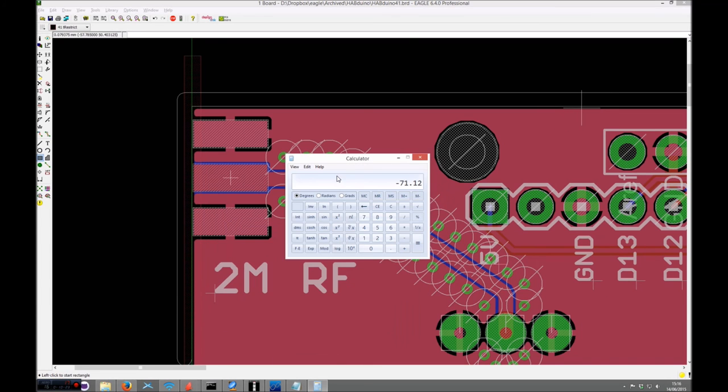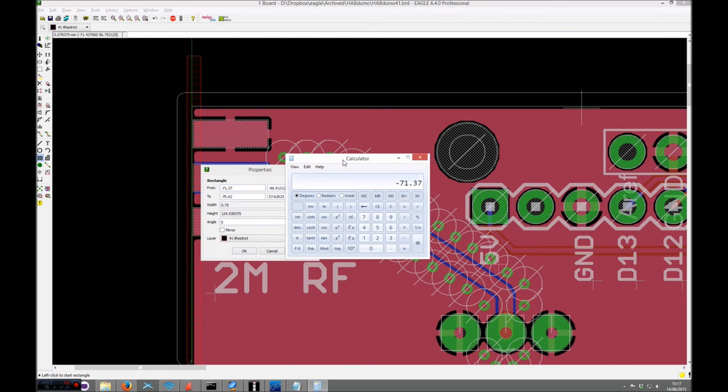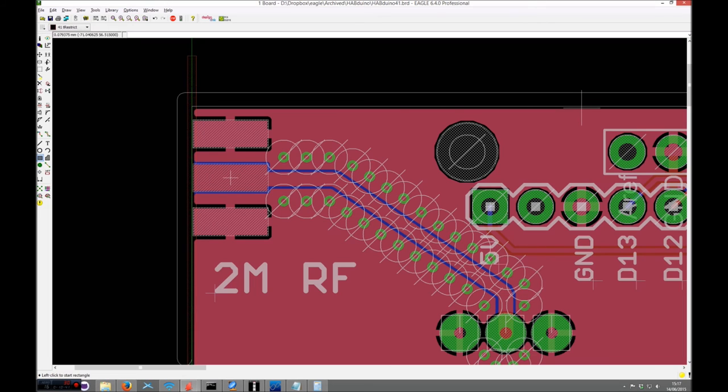Right, so if we just subtract 0.25 from that, and then if we just add 0.5, you now got a nice half a millimeter wide keep out. Now if we click rat's nest, you'll notice that the copper pulls back from the V-score just enough, and you can copy that